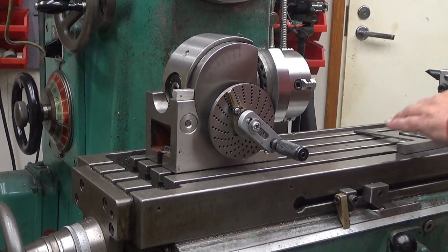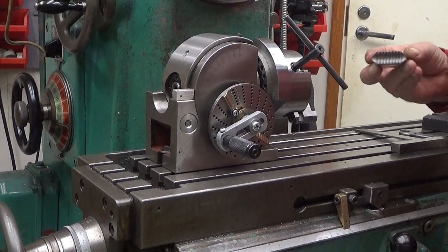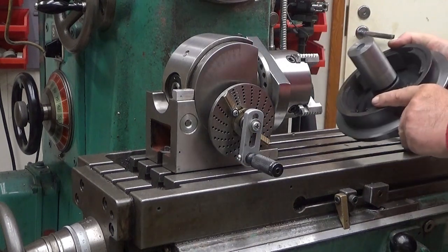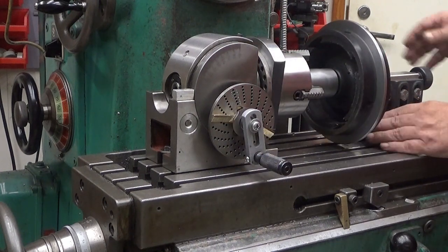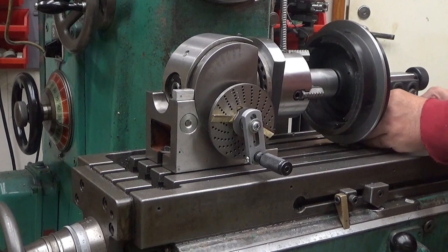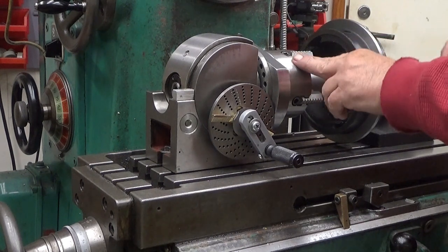put our workpiece into that one. And this is... I probably need to turn the jaws. Oh yeah, and this is also one benefit of a 4-jaw chuck. You can turn your jaws. And I will really place it very, very loosely here, so that it only supports it even so slightly. I'm just aligning this visually now.